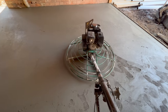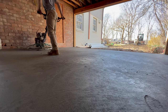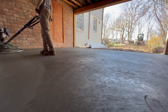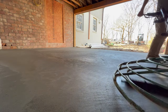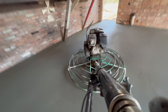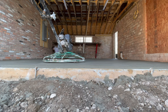If you guys have any questions about concrete, let me know below and I'll do my best to answer them. This is the third hit — you can see where the mini is; I've been getting further down the driveway. Now it's starting to really look nice. These are the final edges by hand — the machine can only get about two inches away from the wall, so if you don't hit it by hand, it looks like crap.